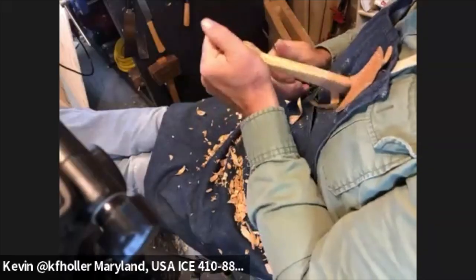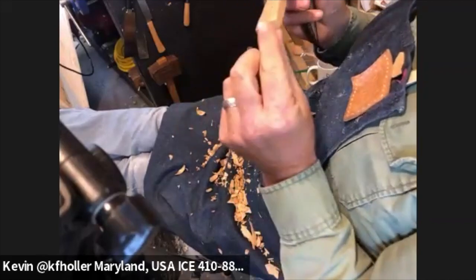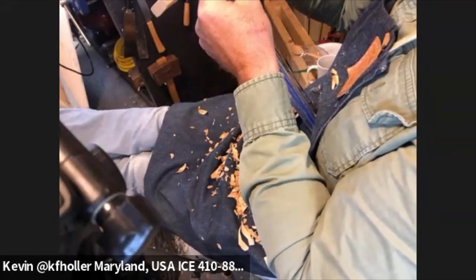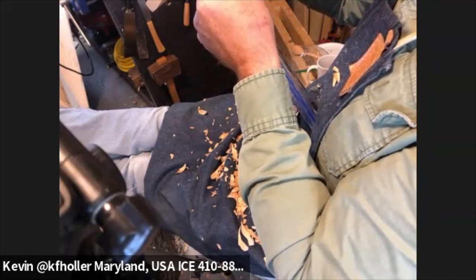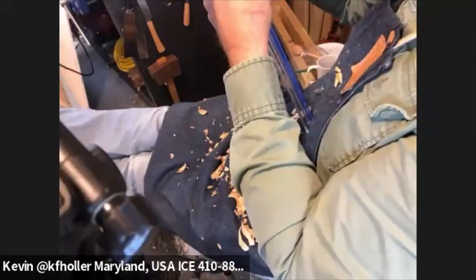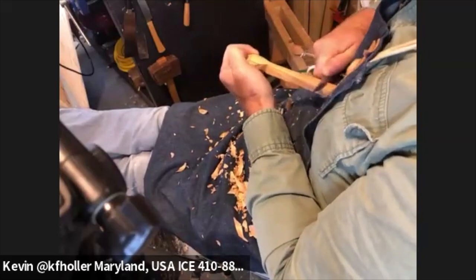Oh, okay. So your handle's pretty parallel at this point too, the front and back? Yeah, I guess it is, isn't it? Mine is definitely thinning. It's thinnest at the very terminal end. Okay, so what's the thickness at the terminal end? Just about a centimeter or half an inch, a little less than half an inch. Okay, that's not bad. Where the hump is, it's about 5/8. Okay, that's about similar. That's similar to mine. Or 1.5 centimeters. What's that, 15 mil. So am I still thinning it down some more? No, that's near enough. Okay.